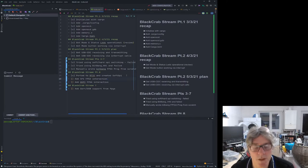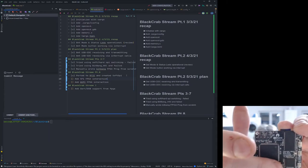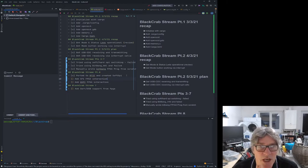So there's several connections between the STM32 on the, just to remind you, it's the right way up, on the ice core, between the STM32 there and the FPGA there. There's an SPI link, including reset and done, which we use for programming the FPGA. There is a TX and an RX which we can use so that if we've implemented a UART inside the FPGA, we read that in through the UART and the STM32. That in turn we can use to send back up the USB, for example, which is what this point is here. That's what that bit will be.